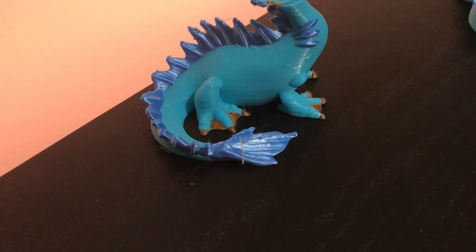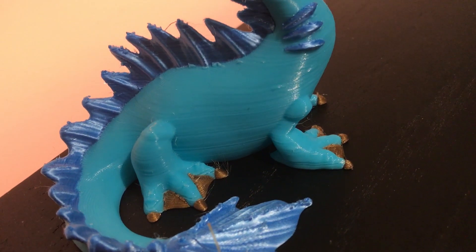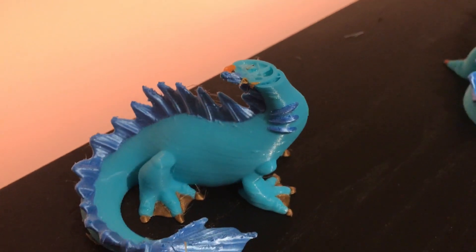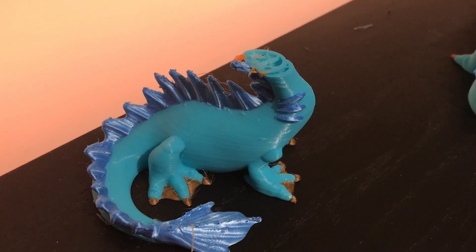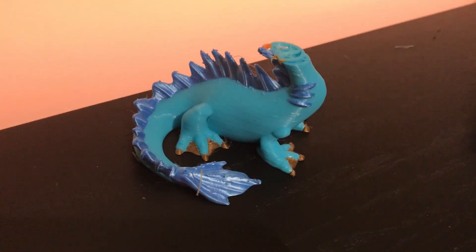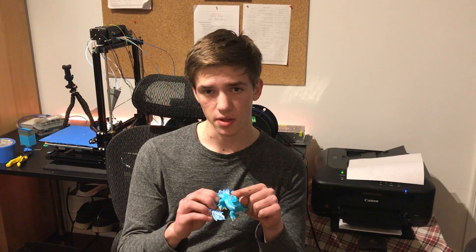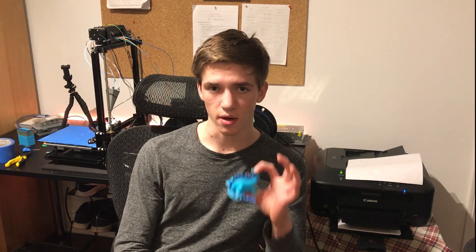The second model is already much better in terms of extrusion, but the extrusion is slightly uneven and doesn't look great. The main fix was to re-tighten the idler and have higher tension. I'm going to need to add some visual markers on the idler body so you know how much to tighten the screws. Regarding the layer skip at the very top, that's because my belt tension was way too high with the little custom belt tensioning system I reprinted — it's really easy to go too high, and the bed was basically not moving and the motor was struggling to keep up.